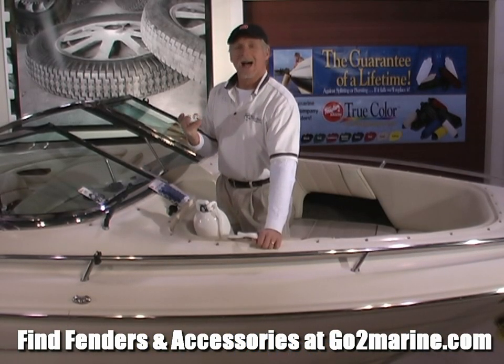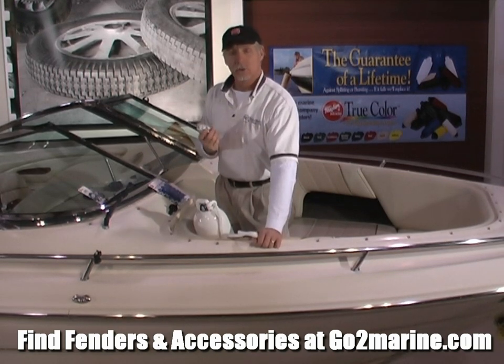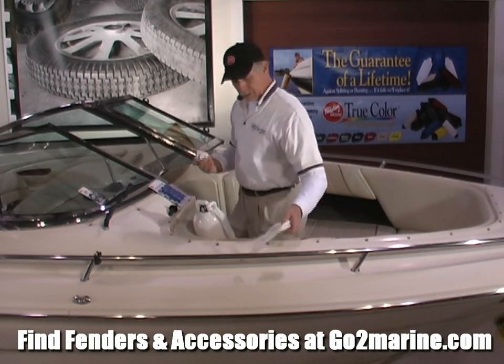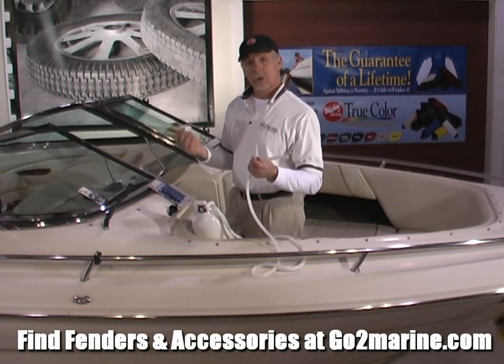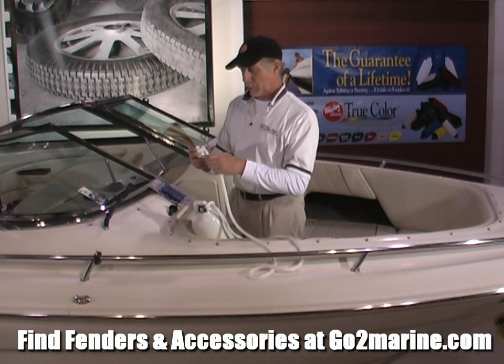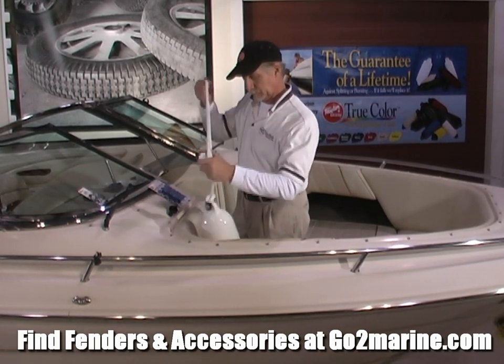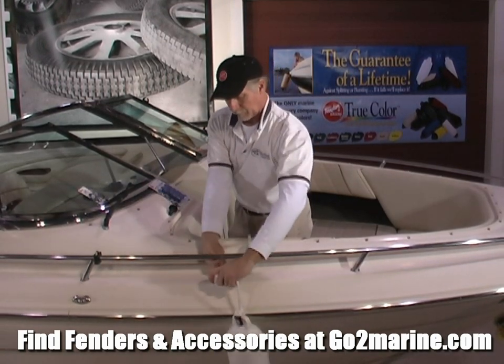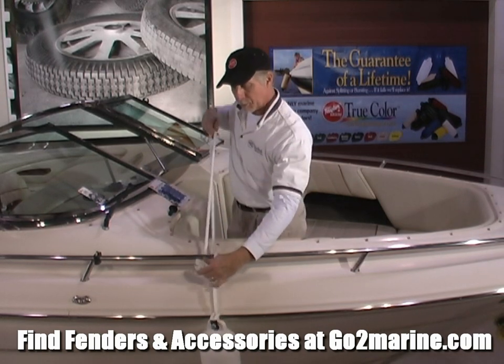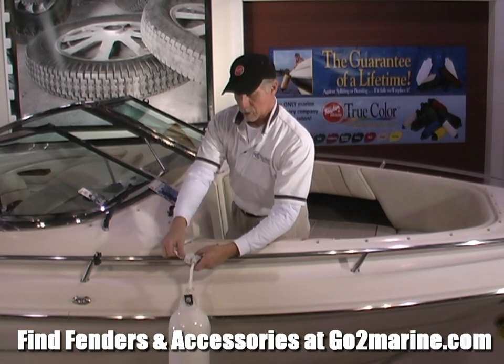This is our no knot fender hanger. Named so because you don't need to tie any knots in using this fender adjuster. How to use it, simply take your rope. It uses up to 3/8 inch diameter rope. Thread it through the back portion of the adjuster. Wrap the rope around your railing and then thread it through the adjuster per the instructions.